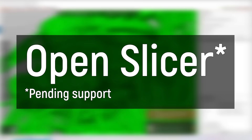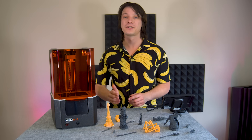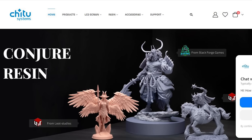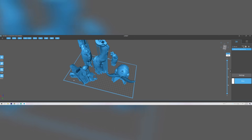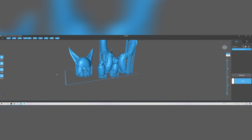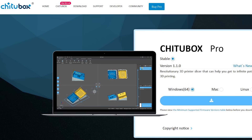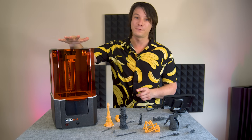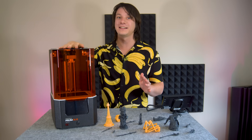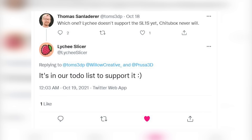Secondly, this machine is not hardware-tied to ChiTu Box Slicer. Almost all other budget resin printers on the market currently use hardware from ChiTu Systems, which isn't terrible and works quite well, but they're locked down to the hardware — you cannot use any other slicer but their own limited and buggy free slicer, or pay $169 a year for a subscription to ChiTu Box Pro. Currently, the new compressed format the SL1S runs is so new that only the latest PrusaSlicer exports it, but they're not stopping anyone else from using it, and it's already on Lychee Slicer's to-do list, so watch this space.